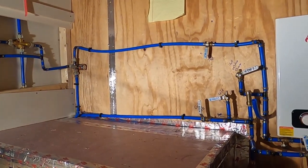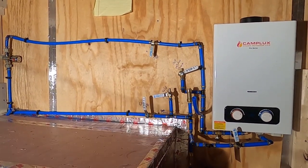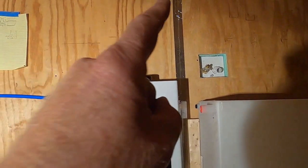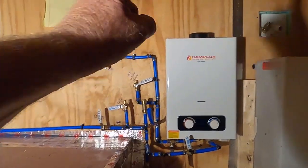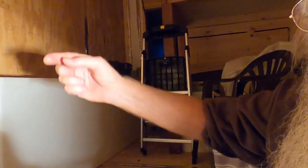I don't know if I mentioned that stub up there with the big brass thing. That is another check valve. That will be hooked into the over there where you can hook up to campground water, so pressurized water comes in. What you don't want is, when you're using the pump, for it to pump out through that opening. That's why that check valve is there, to allow city water or campground water to come in and pressurize the whole system without pushing back through the pump and into the tank. And the other check valve is so you are going to pump it all out.